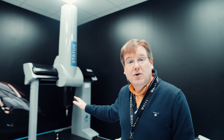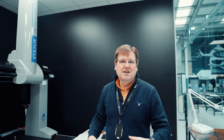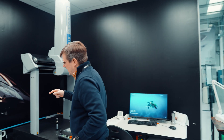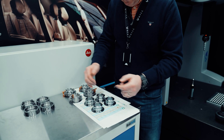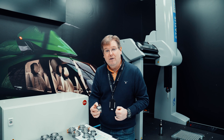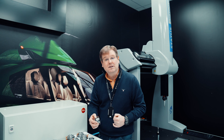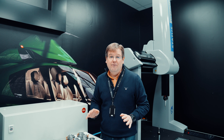You've seen the old commodity CMM that we invested in about 12 months ago. This handles the lower tolerance stuff — main brackets, flight control components, undercarriage, general bits that you only need to tolerance down to single-figure microns. When you're making bearings, as you can see from the various components we're producing at the moment, the cylindricity, the run out, and the profile tolerances are in many cases sub-micron. So they're very, very tight to make these things work the way we need them to and be as reliable as we need them to. For that, you need a different level of measurement equipment altogether.